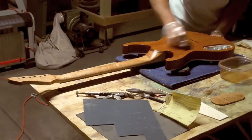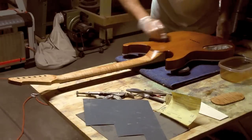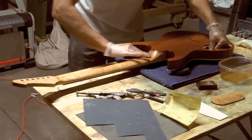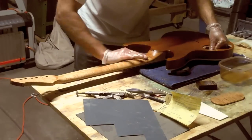If you want a glossy or high luster finish, you will have to use a polymerized pure tung oil as opposed to regular pure tung oil. Polymerized pure tung oil dries faster and allows you to build up layers which can be buffed out to a glossier sheen.